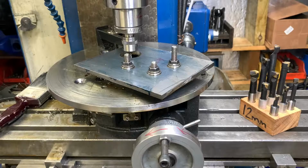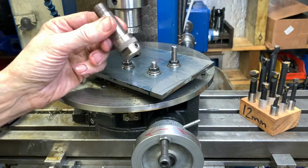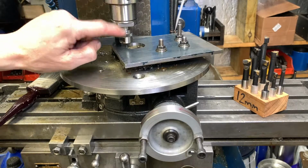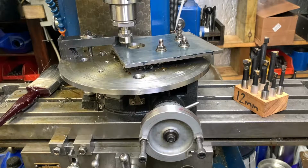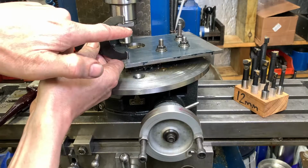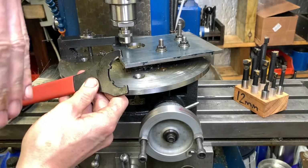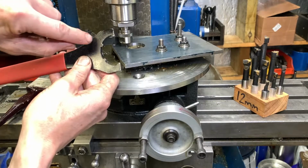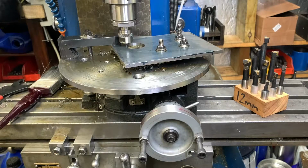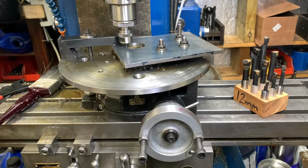So I've got a tiny little FC3 cutter. It's held in a little adapter this time, up inside the collet chuck. Yeah, I've nudged up to the cutter. We're now cutting, just touching. So each of the teeth should have a flat. So we're going to come backwards and forwards, backwards and forwards. And then there should be a diameter cut out as well. And the depth of the cut is 80 thou. So I'll set this block here to 80 thou.